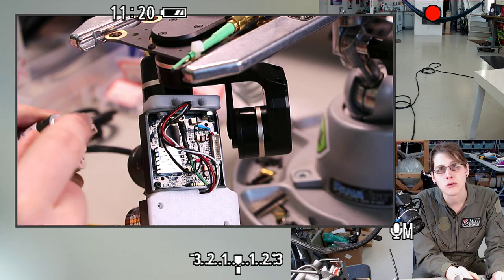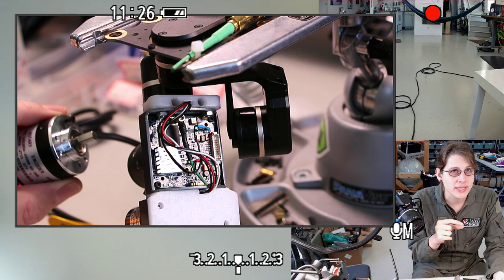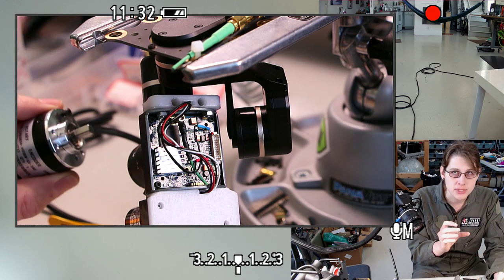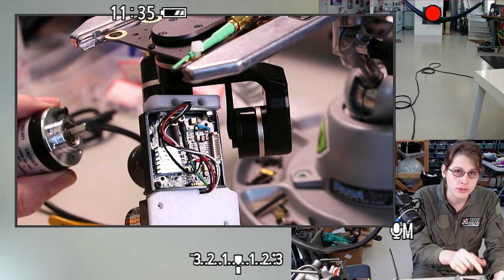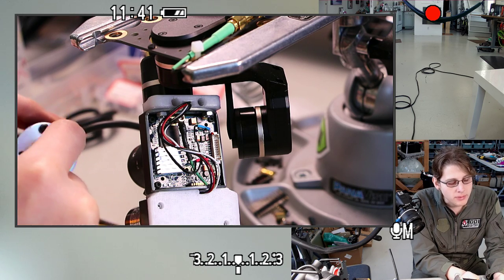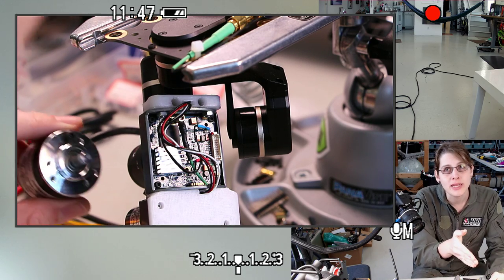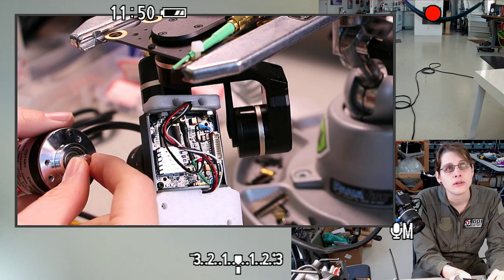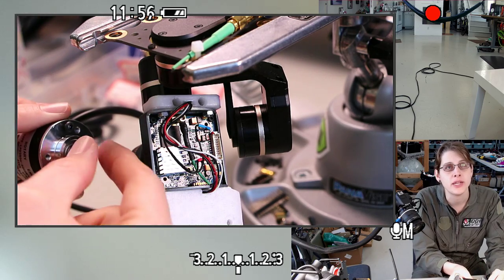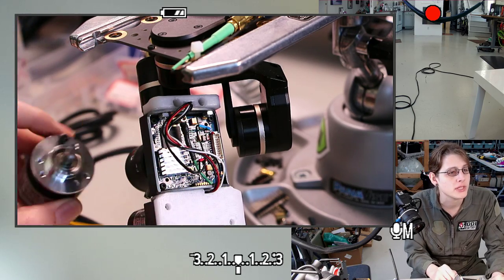It'll look like a pulley that's just wide and has room for a couple of turns. It can't have any features to keep those turns in place, because that would act like a screw that would push the cord off of the pulley. It can just be the right shape such that the cord only has room for the right number of turns, and the turns hopefully stay in place with minimal friction against each other. That would convert some portion of the tension from the robot's weight on this cord into a force that keeps friction between the cord and this capstan, so that the encoder turns anytime the cord moves and they don't slip relative to each other.